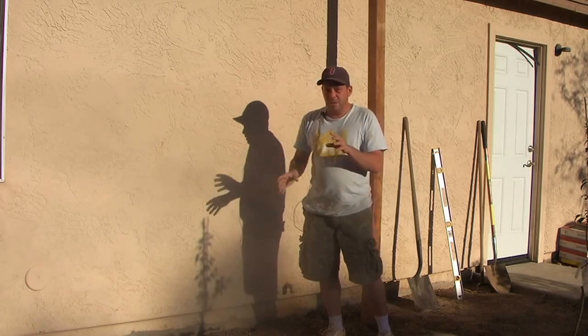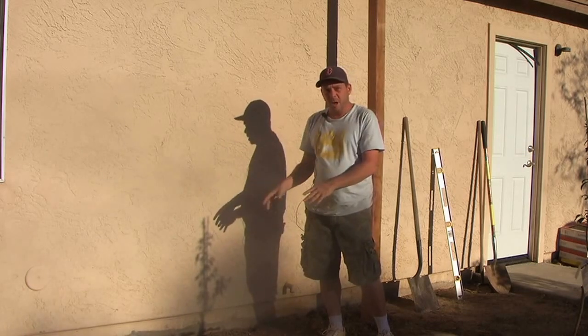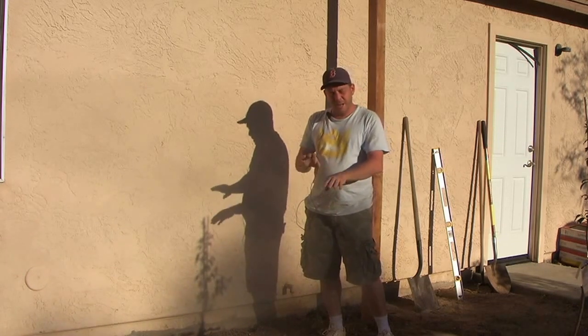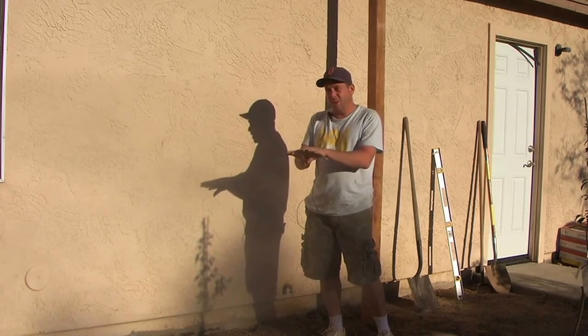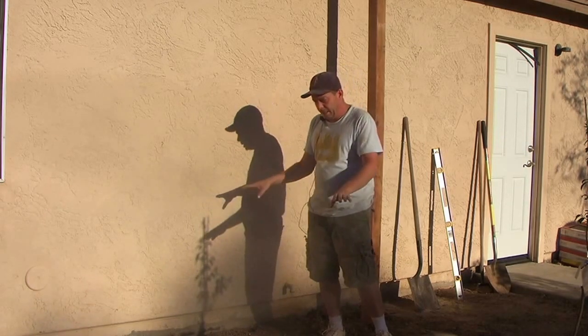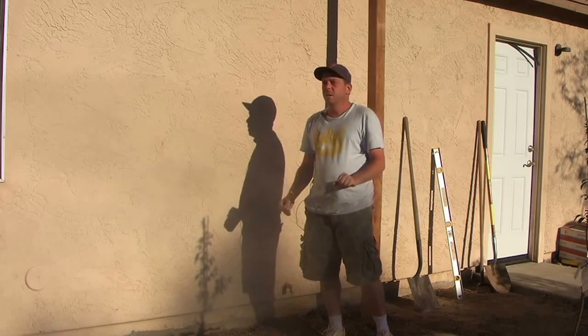So the ongoing things that we're still kind of finishing up right now, like I said, is the soaker hoses. The pavers are ongoing. One of the things that novices learn as they're putting in the pavers is it may look like it's level, but it's really not level. And so there's a lot of laying it down, checking it for level, pulling it back up, readjusting sand.